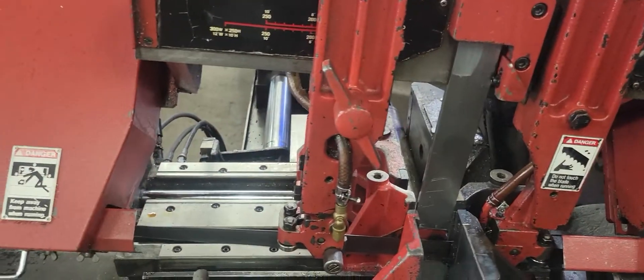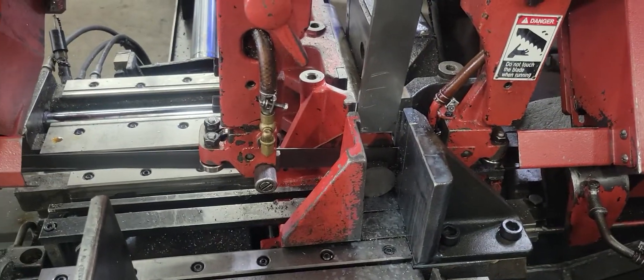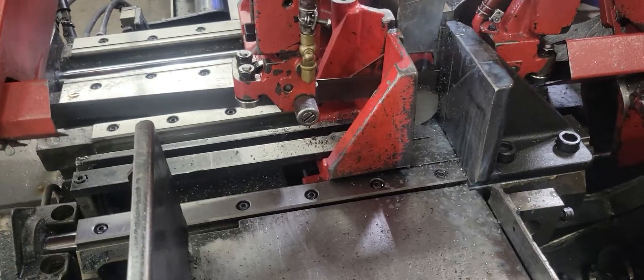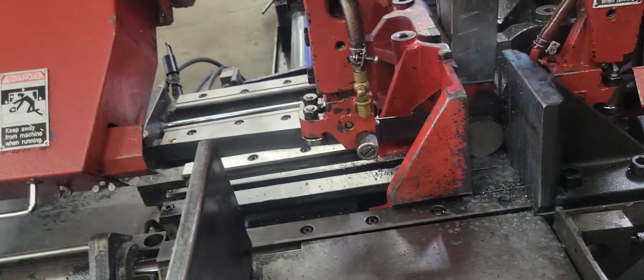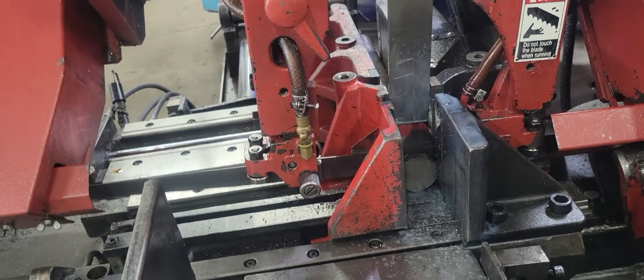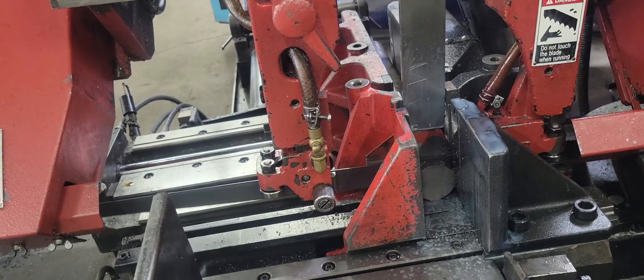You'll see the wiggle in the vise — that's intentional, because they leave it extra loose so the rear vise does not drag against the part and make marks on it. There's no need to adjust the height after the first piece. The flag in the middle here will hit the part and put it into feed mode. It also knows to lift up just past that flag coming down — all these features are designed for production.